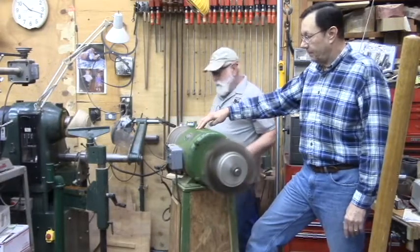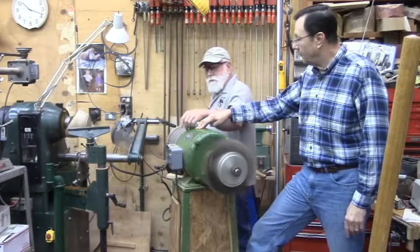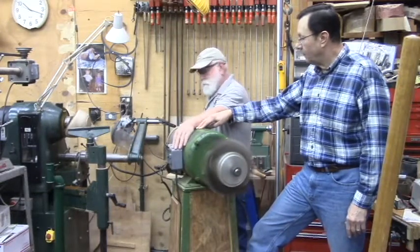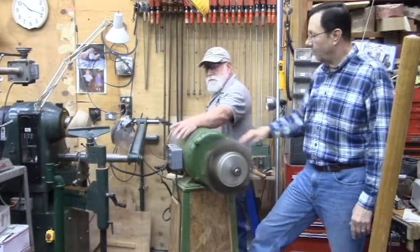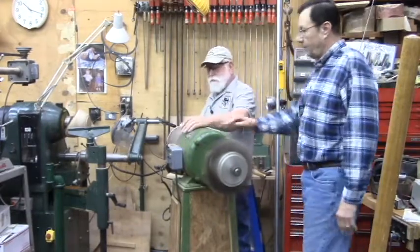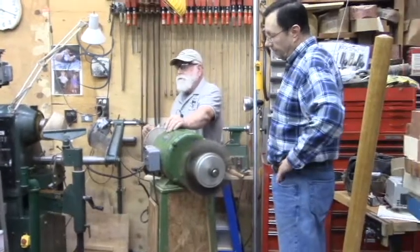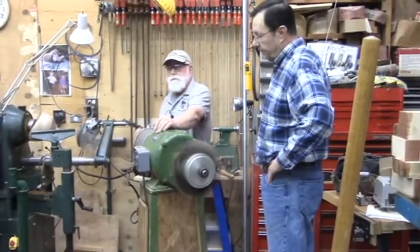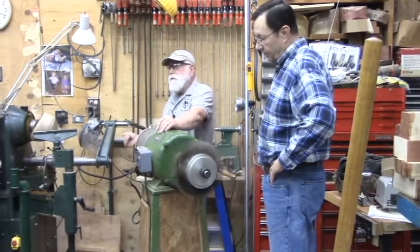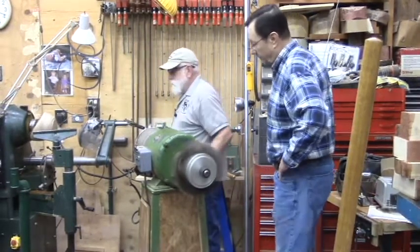Your switch is on. Well, that switch, Joe, I've got it disconnected. I took the switch out of the circuit for 2 reasons. First, just to save us some time this morning, and second, most variable frequency drives recommend that you don't switch the current coming out of them. If you want to switch them, you switch the current going into them. So that's why it is like that.